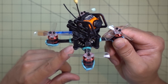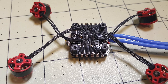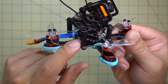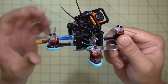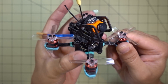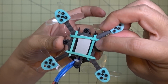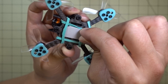The way you put this together is I just flipped the power cube over and soldered my motors on underneath, so the motor wires go underneath the 4-in-1 ESC. Once you do that, I attach the main plate to the cube using four screws on the bottom, which you can't really see — they're under the rubber bands. There's one of the four screws right there.